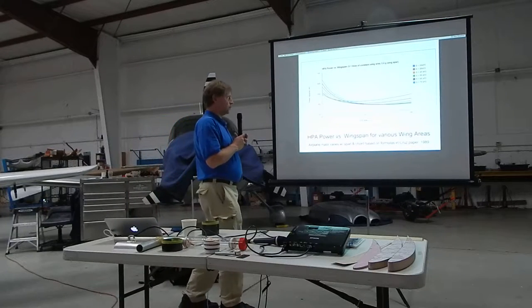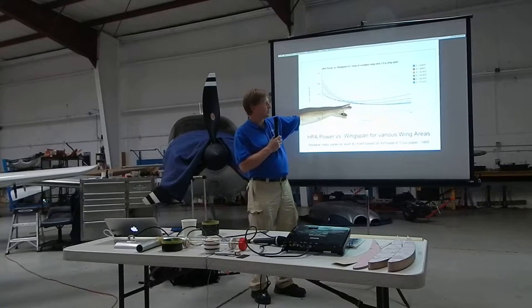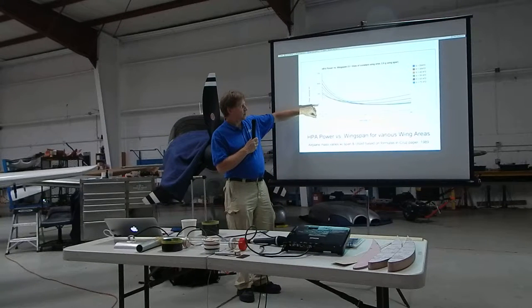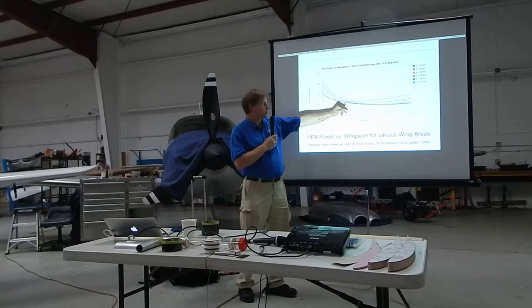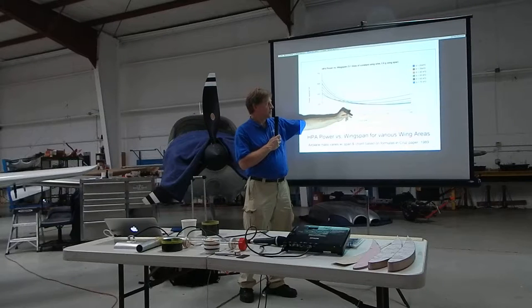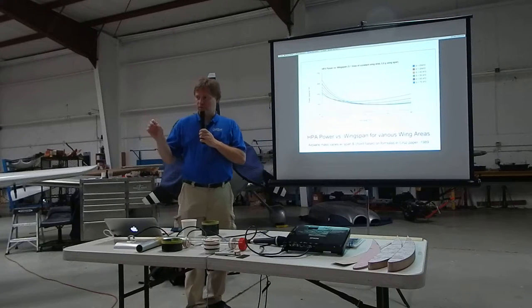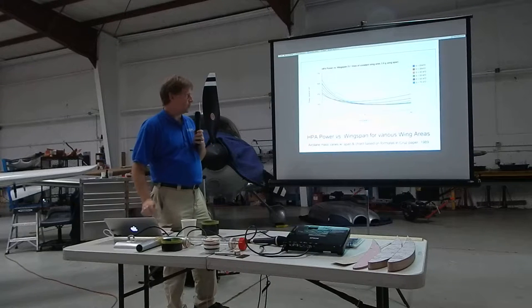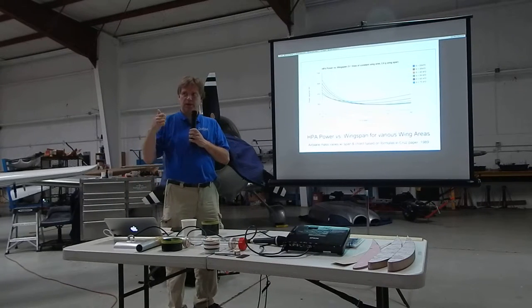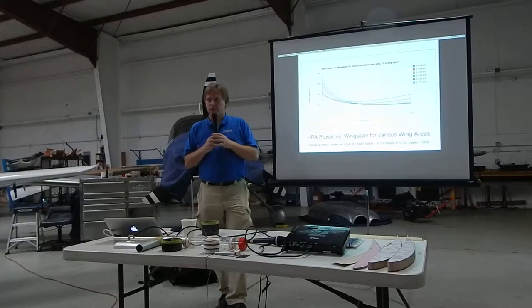With human-powered airplanes, it's all about wingspan. This shows a bunch of wings of different aspect ratios, but they all converge on the same place — this is using that spreadsheet. For the max-weight pilot, a really fit pilot could put out about 300 watts. And in order to sustain 300 watts for a long period of time rather than a short burst, you need to have an airplane that's over 30 meters. So I ended up making our base design 33.3 meters. Then I designed a series of wingtip extensions and longer outer wing panels giving several options all the way up to 40 meters. Interestingly, at human-powered airplane competitions in Japan, England, and Korea, everybody always makes their wingspan too short. If you make your wingspan 25 meters instead of 30, you need 50 percent more power to fly.